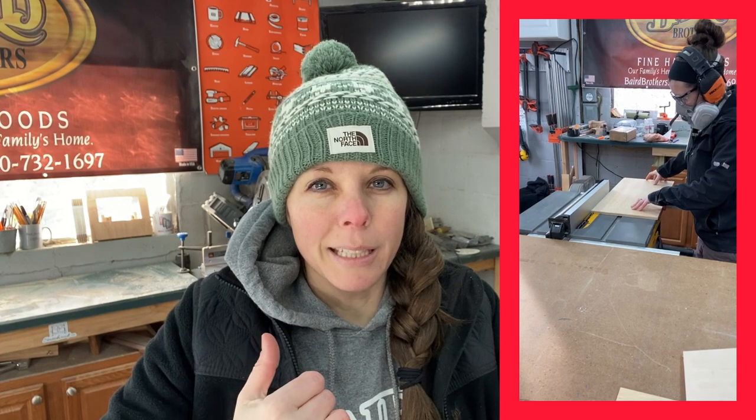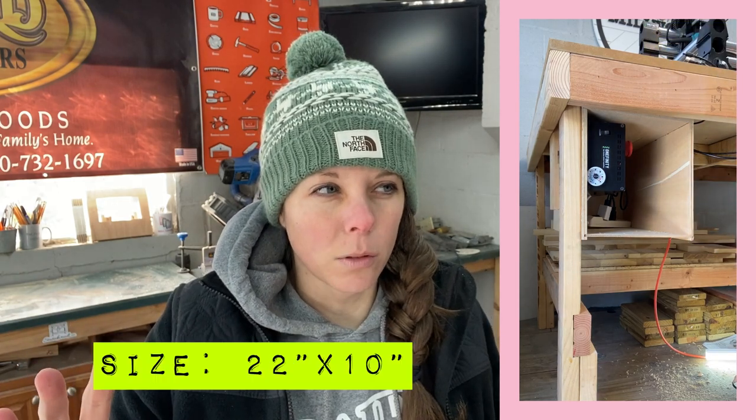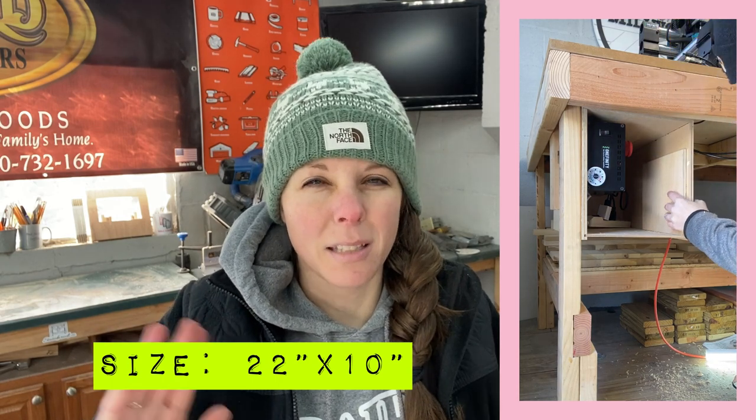Some main considerations for building this box: size — I didn't want it super big or really tiny. I wanted some natural airflow in there, because your light bulb and your machine while running will both put off heat, and there's a cooling fan built into the Onefinity control box so you want the air to be able to move a little bit. The door on mine isn't super tight-fitting — there's a gap at the top that wasn't entirely intentional, but it ended up being a blessing in disguise for airflow. My overall sizing was somewhere around 22 inches long and about 10 inches wide.